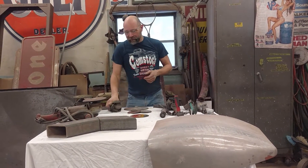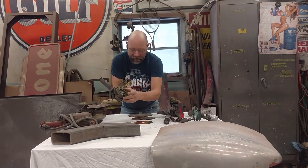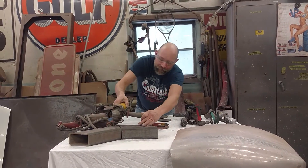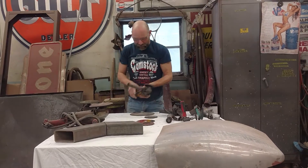When you're grinding something, use a kickstand — I'll use a hand for that. So if I'm grinding this, for example, with a nice flat wheel, for finishing purposes I'll put a hand down and then run the grinder back and forth very evenly like this, but not terribly fast.